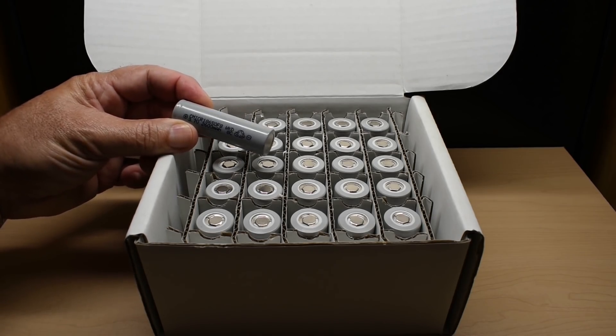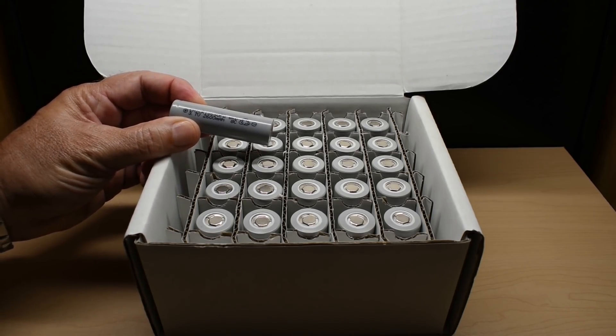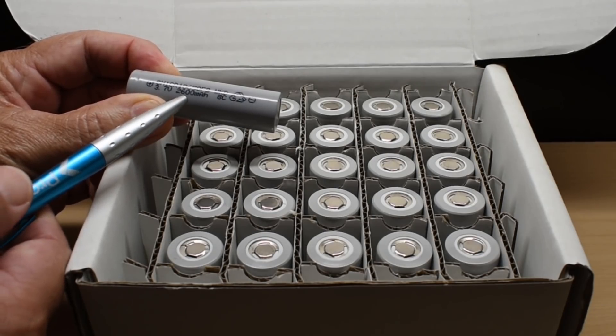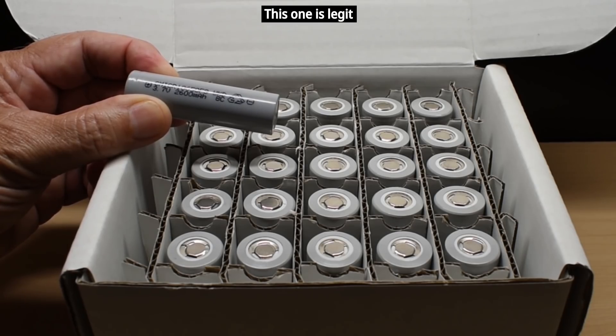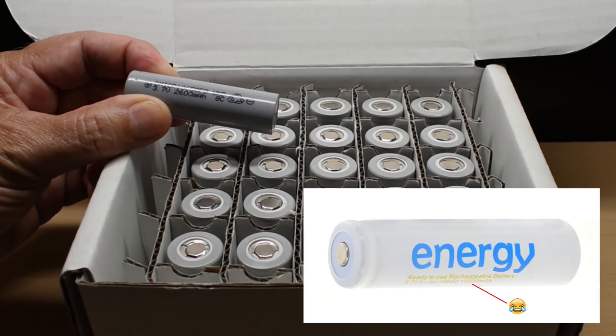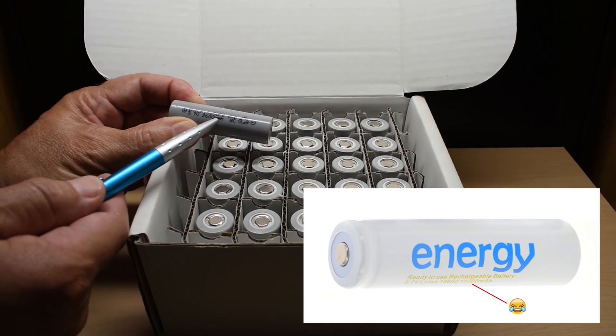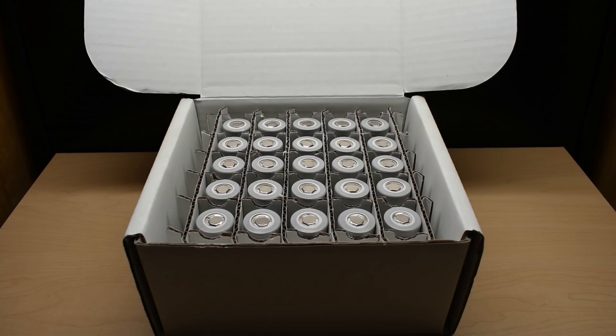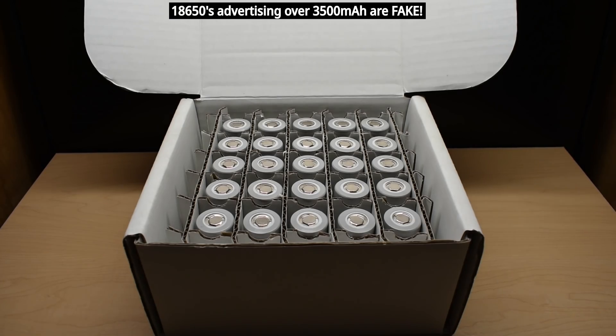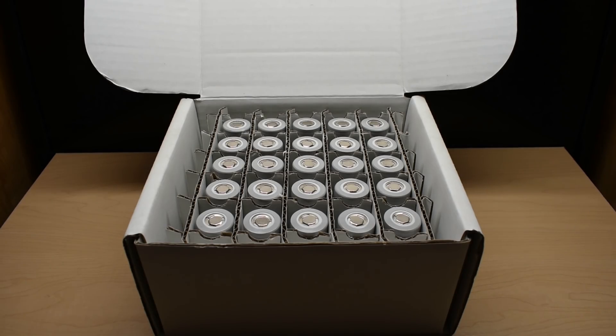Knowing how many cells are sold online, especially from China, where they give you a capacity rating — this one here is 2,600 mAh — some of them go as high as 5, 6, 7, 8,000 mAh capacities, and that's for an 18650 cell like you see right here. Unfortunately, an 18650 has a max capacity of around 3,400 mAh. So what I like to do on my channel is test certain cells or batteries to see which one performs the best and has specifications as close as possible to what the manufacturer states.